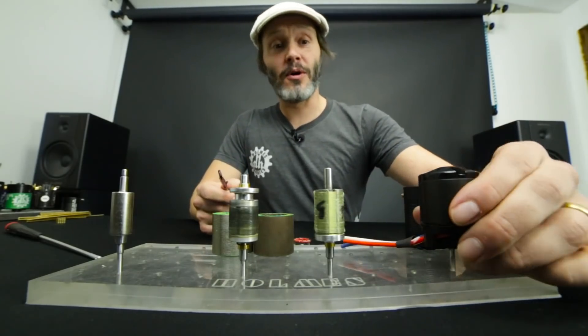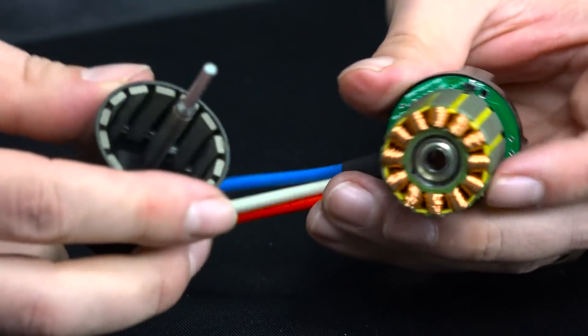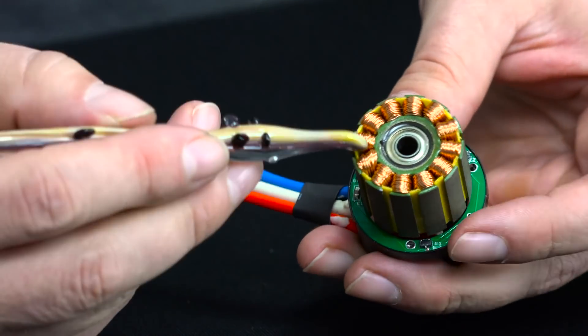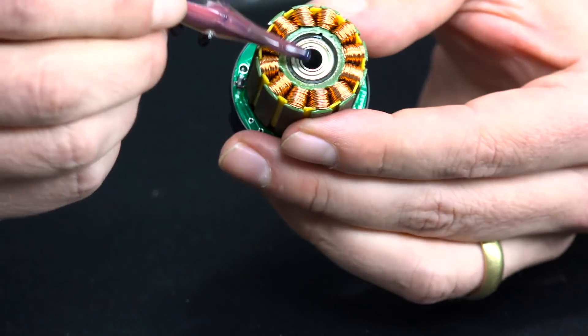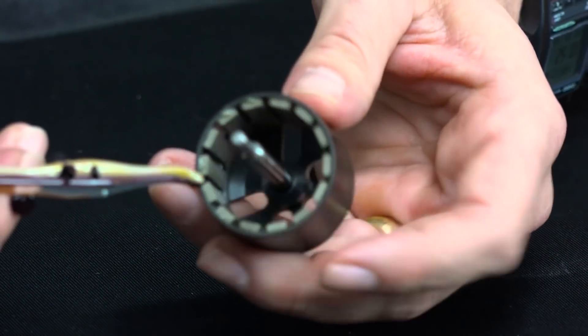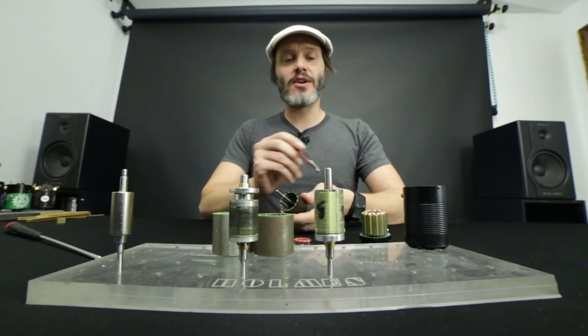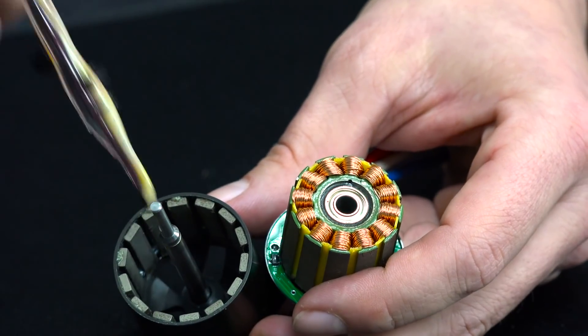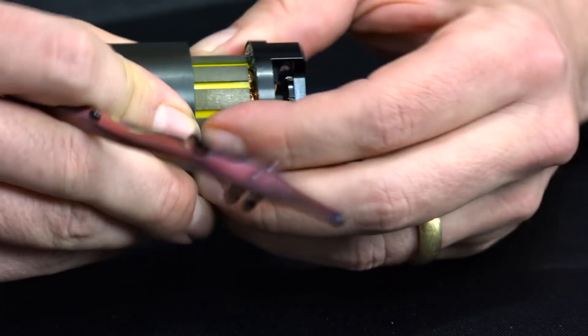There are two pole and four pole motors, but also six pole, eight pole, and 14 pole. As an example of a 14 pole motor, this is a Revolver 540. It takes apart pretty easily on this one — no circlip. Here's our stator, and you can actually see it much more easily here. You can see the copper coils wound around it — it's a distributed LRK pattern, terminated with a Y. You can also see the bearings the shaft rides through. Technically this is a rotor, though the rotor is on the outside of the motor this time. You can see there are a lot of magnets inside — this is a 14 pole motor with a 12-slot stator, so there are 14 magnets (seven pole pairs) and 12 slots.